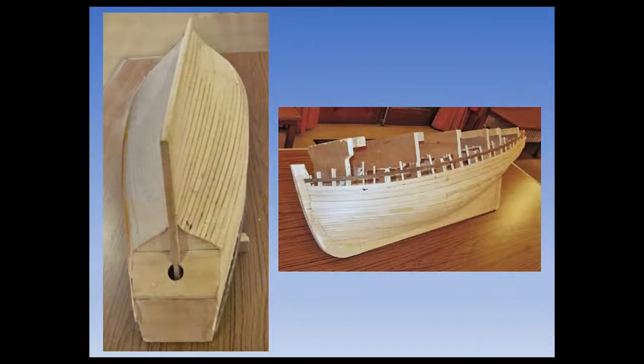The left-hand photograph shows the point where I decided I had a real problem: the clinker planking is only a sixteenth of an inch thick, and where it meets the carvel it gives you a sixteenth-inch butt joint. I didn't think that was at all safe on a working sailing model, and because of the way I built the thing with the formers it would have been very difficult to reinforce that joint. So I decided to turn the clinker back into carvel — on the left side the clinker has been filled with car body filler and rubbed down, while the right side still shows the original clinker.